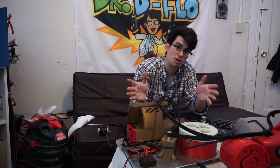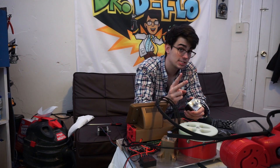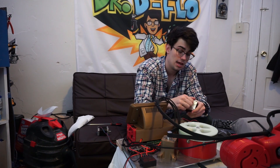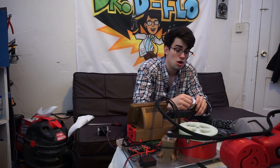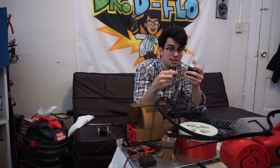So we were programming the robot and the shoulder started to lose power. At first we thought it was a connection issue. We checked all the connections — no problem there. So we disassembled the shoulder and found out that the pulleys on both of the stepper motors were slipping. Even stranger, when we tried to remove the pulleys, which are sandwiched in between the plastic, we couldn't do that, because they were stuck. So they were slipping, but they were stuck.